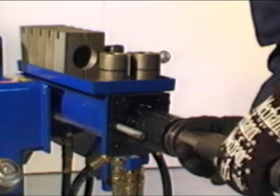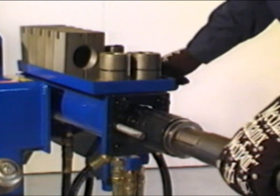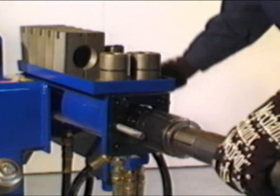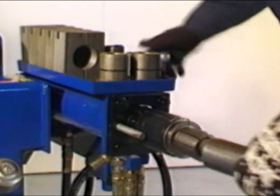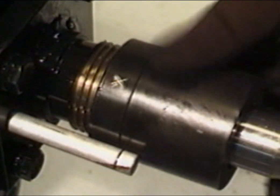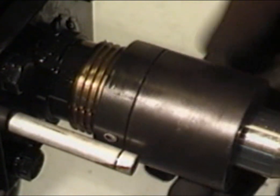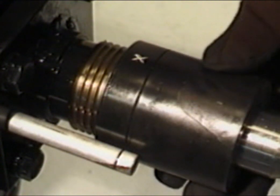If there is a burr or dent on the end of the tubing, place the tubing on the notched end of the segment expander and tap the valve handle until the burr is removed. Adjust the buttress canister until the grooved line on the canister is lined up with the grooved line on the pointer. Then center the X symbol on top. With the buttress canister properly lined up, the arbor will automatically stop with the tubing expanded to the exact inside diameter for that corresponding segment expander.